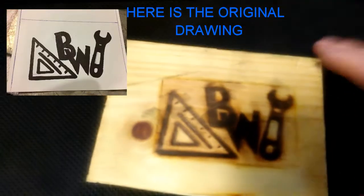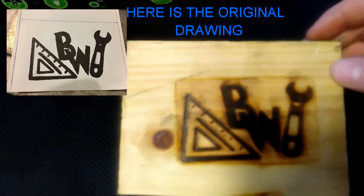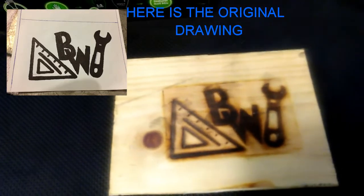Okay, and then like what I was talking about the last time that I had videoed here, went in with a 1/4 inch end mill and got all this down as close as I could, and then finished it out with the little grinder, and it came out pretty good. Like I said, I've already tested it. Here's the test piece. So I'm pretty happy with that. I've sent Brad a picture of it, and he's happy with it.